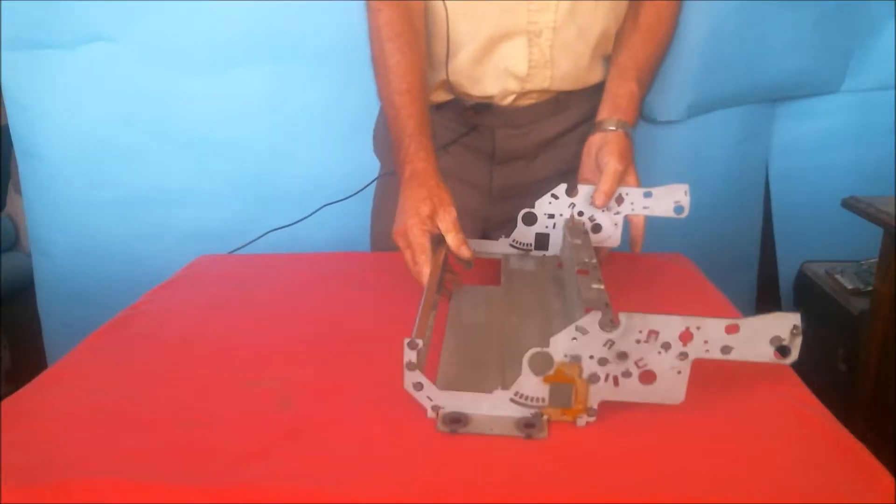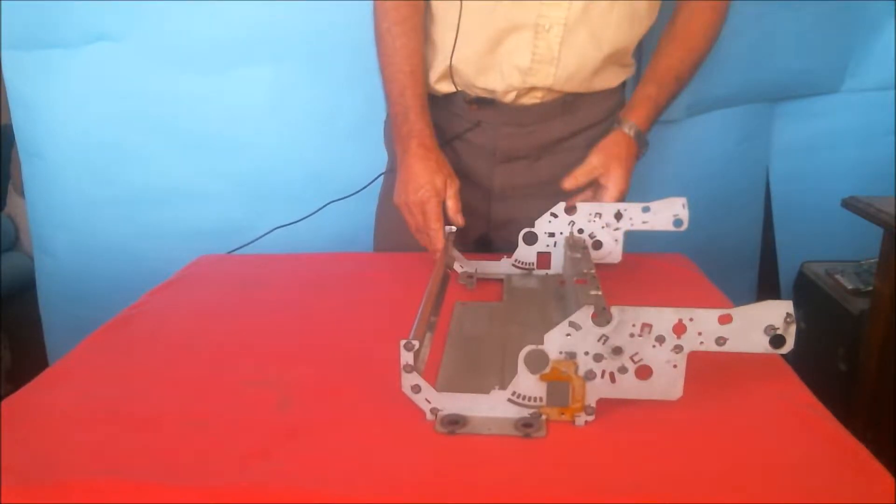The main structure or frame of the tumbler comes from the inner frame of a printer, but not all inner frames of printers are the same. Many small printers have a staircase structure in them and they are not useful, just like this one. This frame leaves very little space for putting a pair of big rollers and a motor, and it can topple over very easily.